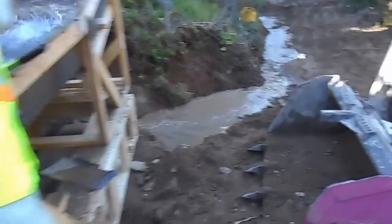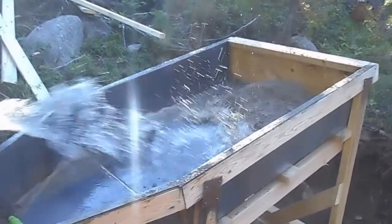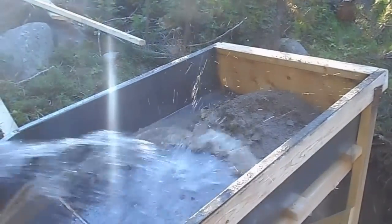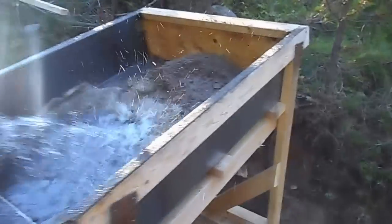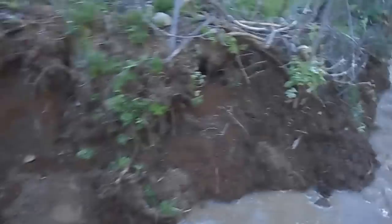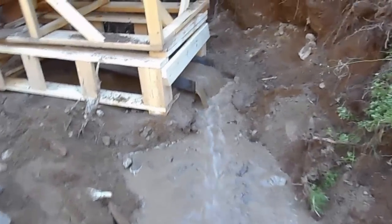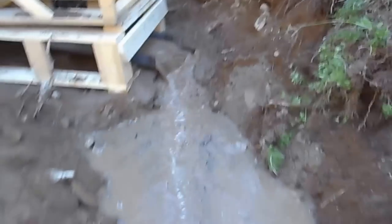We're gonna pull a little 1-inch pump out here for next day and see if we can use that to just help the guy that's running the plant wash things through. I'm gonna put one more 2x4 under that end. Just about perfect. A little bit better, steeper? Oh yeah. A lot of stuff going right through, even on the bottom of that. Excellent. But you can see there's some rocks that are starting going through there. We just don't have quite enough water.